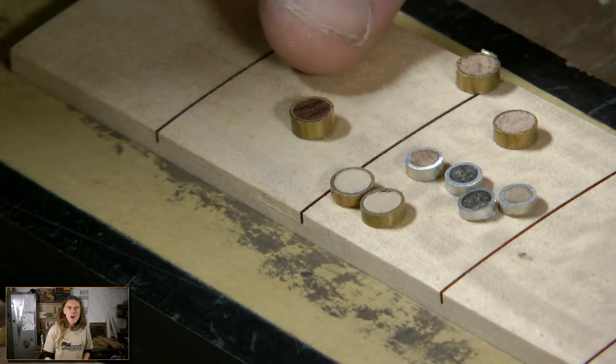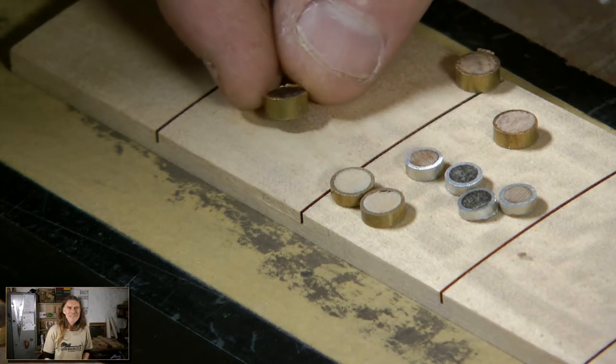The problem is, it's okay for inlay stuff where I'm just gluing an inlay into a hole. There's no structural strength needed. But if you're laminating a neck, it needs to be strong. One problem when you're gluing two different things together, like plastic to wood or wood to metal, is that glues are made for certain materials. Wood glue won't work on metal, so you'd have to use a special kind of glue. Off the top of my head, I would imagine that epoxy would probably work, but it's not recommended. Another reason you might not want to do it is because wood and metal expand at different rates, and that will eventually crack the joint open. So that's probably the main reason that I've not seen it done.